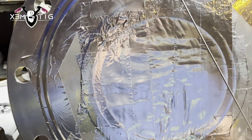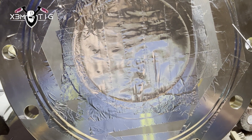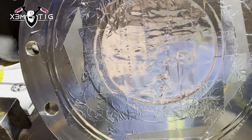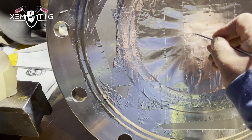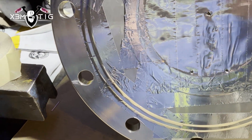I'm gonna use a 10 inch gasket. The main reason is to protect the face of the flange, and the other reason is to reduce the hole area so I don't waste too much aluminum tape. I'm gonna poke a hole in the middle and holes all the way around — that's gonna be my vent side, where all the purge gas pushes oxygen outside the pipe.